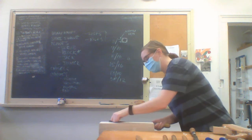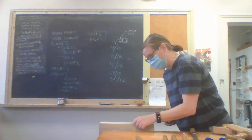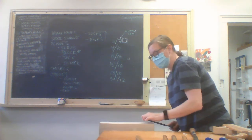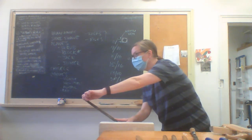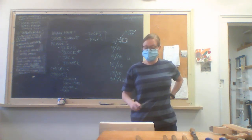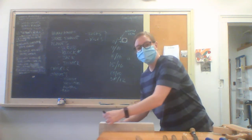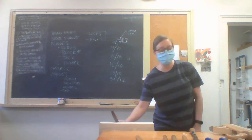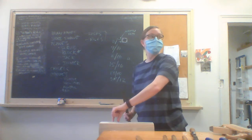So I'm not doing this because that's kind of silly. You guys see? I'm sorry. But rather I'm moving it over and through at the same time. So I'm starting one corner here and moving the file as I'm moving the cut. It's hard to describe. What I see a lot is this, which isn't doing anything because you're moving the same section over one area a lot. Or I see a lot of this, where you're just working one little section here.